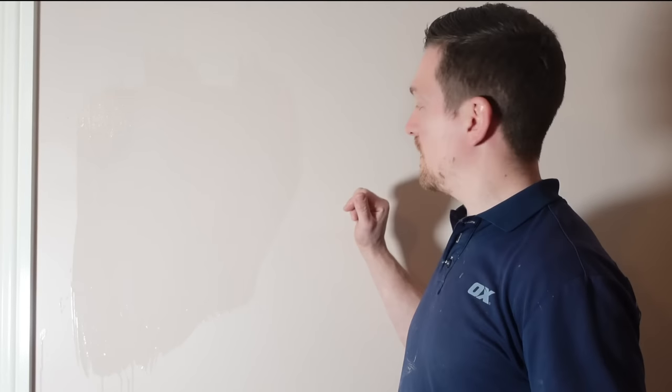The only issue with these pre-grits and these primers, like blue grit, this pre-grit, green grit, yellow grit, all the grits, you've got to wait a day for it to dry. Where PVA, this could be dried within even 40 minutes sometimes, 30 minutes, depending on how fast it pulls in on the walls. And then for me, a painted wall like this, PVA is more than good enough.